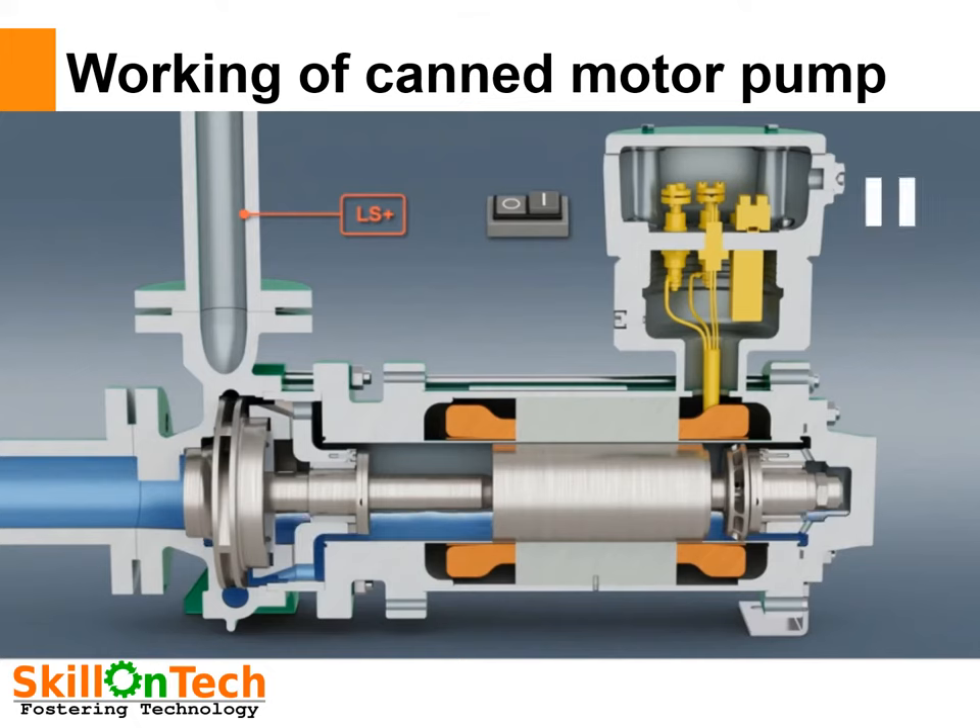You can see from this picture the water is entering through suction and filling the complete entire casing of the pump. The pump casing is now filled and the air pockets inside are getting kicked out through the discharge pipeline. Once all the air is removed, a level switch installed in the discharge pipeline gives a signal to the power supply to turn on the pump. The level switch is now on, power supply is resumed, and the impeller starts rotating.